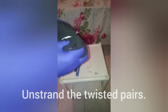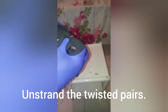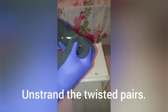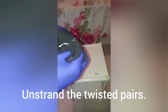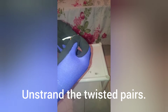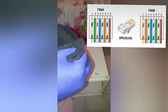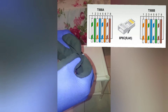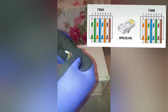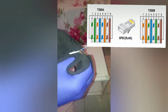Now we will un-strand our wires — they come stranded so we will un-strand them. While we do that, note that a cat5e or RJ45 connection is normally made with one of two wiring standards: T568A or T568B. The most commonly used one is the T568B, and that is the one we will be doing today.